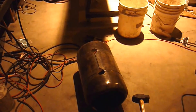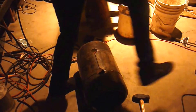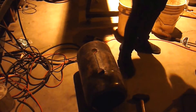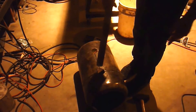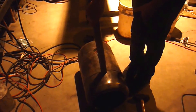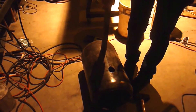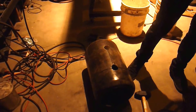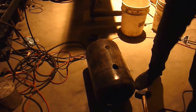So I ended up plasma cutting out the two holes right here and right here. They aren't perfect but they're good enough. I'm going to cut this into about three-inch sections and that's going to make up my flange for my burners to go into. It fits in there with a little bit of clay, but I can weld around that. That's going to be my flange.